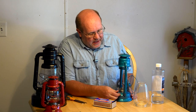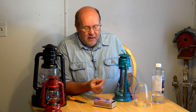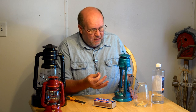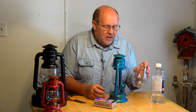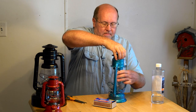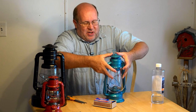It's been about 20 minutes and I can see the color of the wick has changed. If you want to check, put your finger on the top — it looks kind of waxy, but you can tell there's a liquid on your finger. That means the fuel has been soaked up sufficiently into the wick. So we can go ahead and reassemble, pulling the retaining springs up, and we'll do the first light on this new lantern.